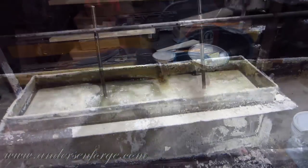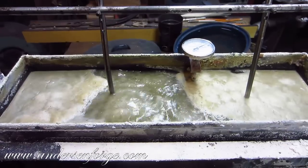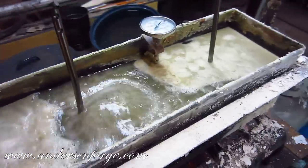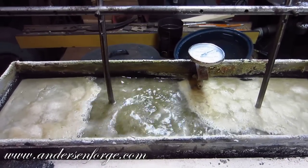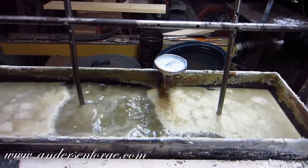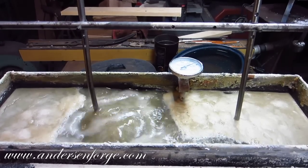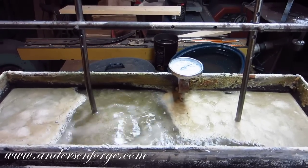Now I'm going to stick the knife in. Okay, I have placed my blade in the tank — I have it suspended. For the next half hour, it's kind of boring — I just sit and watch, maintain the boiling temperature, and continually replace the water that's boiled off so the boiling temperature stays at exactly 292 degrees. Two things are important: one is the cleanliness of the steel. The steel must be almost what would qualify as surgically clean — there can't be a speck on that steel or it could inhibit the bluing process.